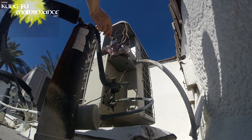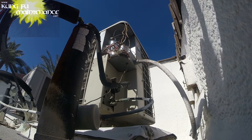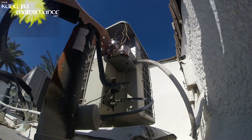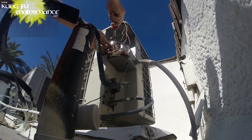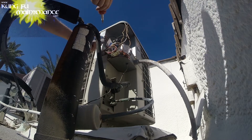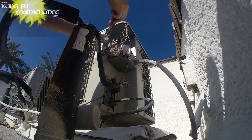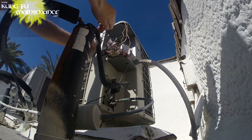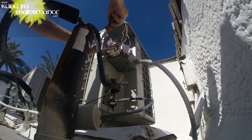I need to re-discharge the capacitor. The capacitor holds the charge in it even after the power is disconnected. So it's all discharged. This one's got common as the red and common as the blue. And then we've got a hard start kit.